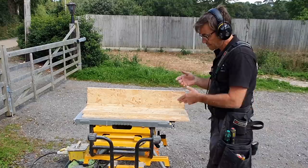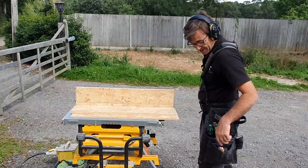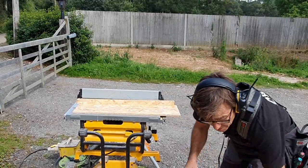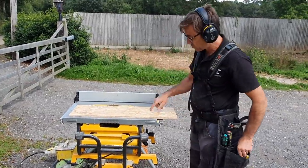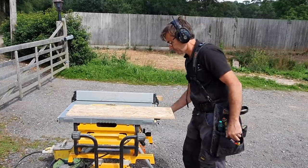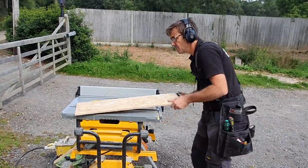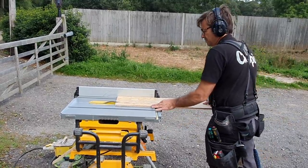What I'm doing is making the sides — obviously they need to be two thicknesses of OSB, so I just stack them together here instead of adding them up, give myself a mark, that's the top and the bottom. I'm making that out of 12mm; these are out of 18mm. I can just put a small screw through them and that comes up at 192mm. We've got a nice straight edge on that bit of board, which is what we want.